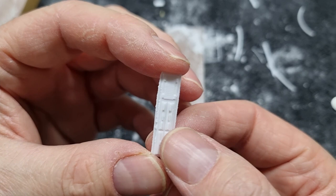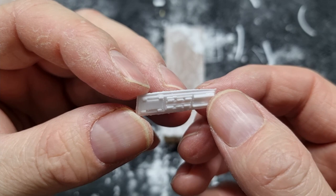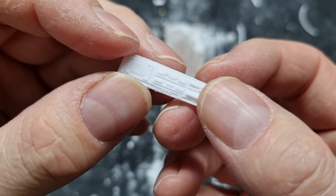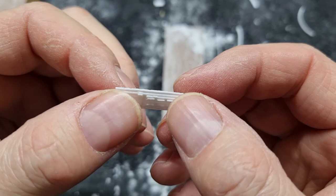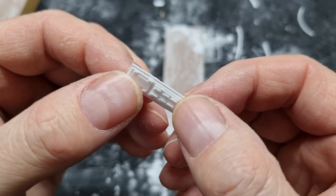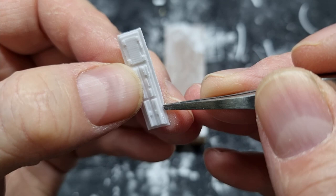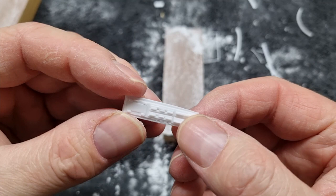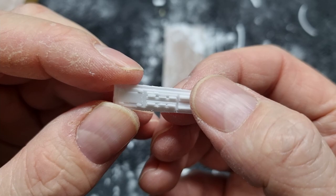Worth mentioning: this is a very thin, fragile detail piece with really thin sections in the middle. Take extra care when back-sanding not to crush those parts or blow through. If you reach a depth where you're worried, just stop and sand the edges flat to where the part edge should be. Take it as thin as you're comfortable with and finish the edges off.